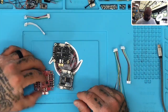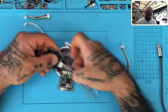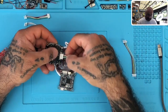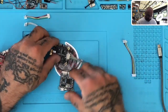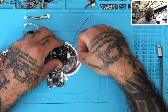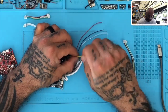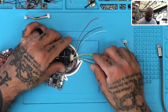The first thing I want to do is look at the JHEMCU. This board comes with this harness. The harness is just tinned on the other side — it is not terminated or capped. It is left open and tinned. If you want to know the wire pattern: VBAT, current sensor, ground, no use. I don't know why this wire is on here, but the cable was most likely made by a third party and they just included it as part of their standard harness. There's a no-use on this cable.